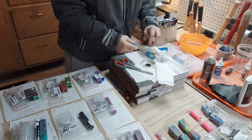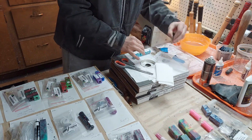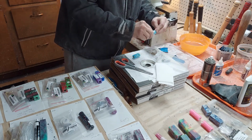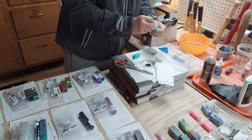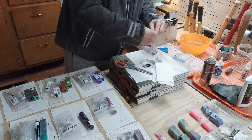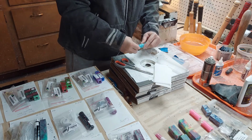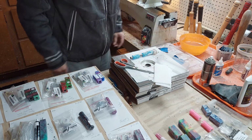Now, Princess pen, you have a bottom barrel, you have a top barrel. The bottom's an 8mm tube, small bushing, center bushing, top's a 10mm tube. So you can't really get these backwards. It's pretty foolproof. Okay.